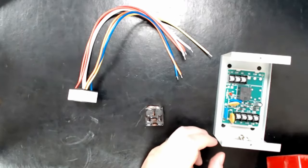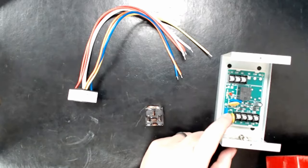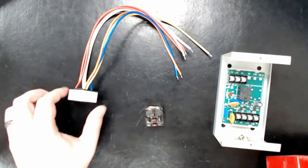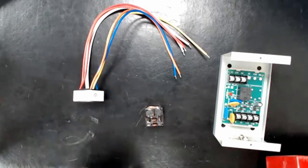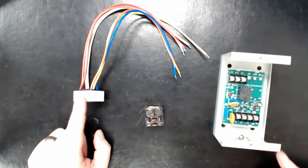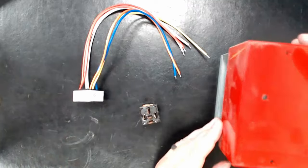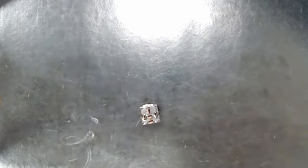That should take a minute or two because it's very straightforward, and then we'll talk about how the terminals and wiring work. Over here is a PAM-style relay, so we'll talk about that as well. These are the two kinds of relays we'll see most in fire alarm work, but this one gives an easy picture of what's going on inside.